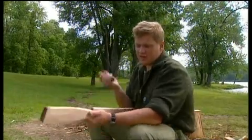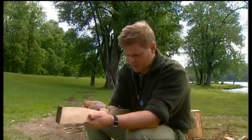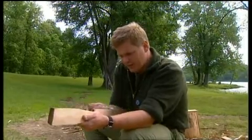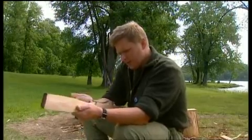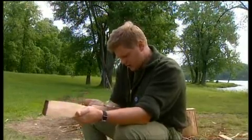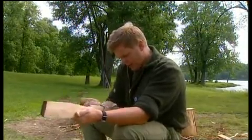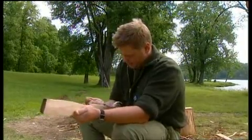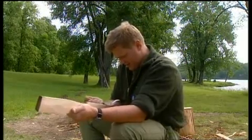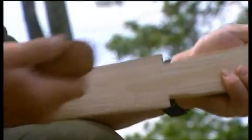It's also nice to use the crooked knife. It's a wonderful tool. It gives you a really good clean finish, because as you shave with it, you can see the effect you're getting straight away. But I have to say, I'm not used to using this tool, and now I'm waking up in the mornings with my hands literally on fire with aches. But my hands are about to get an unexpected break.